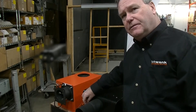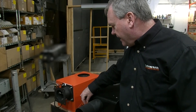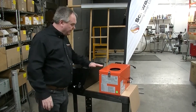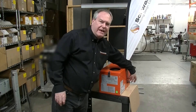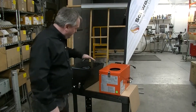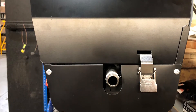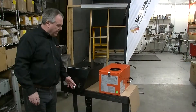The igniter is still installed on the right side of the burner when you're standing behind it. Some other changes we can see on the backs of the burners: on the old Premier series, we had the gas connection on the right side of the burner when standing behind it. This was tough to access sometimes, so on the new burner we put it directly in the center of the back of the burner, and this allows access from anywhere when connecting up our gas.